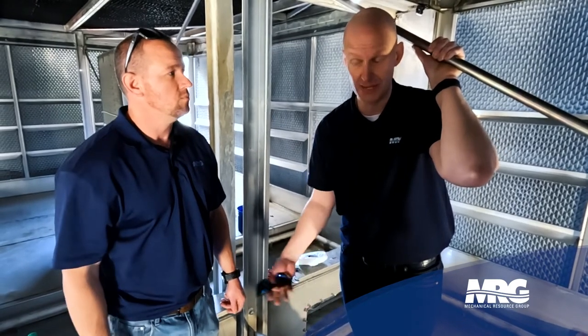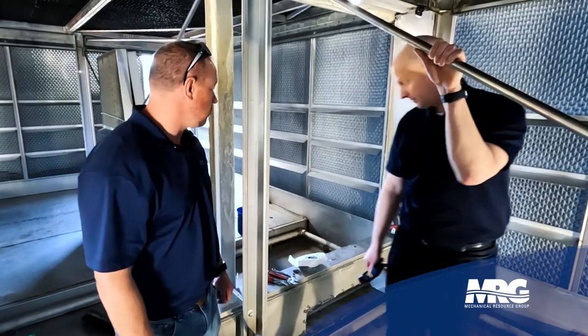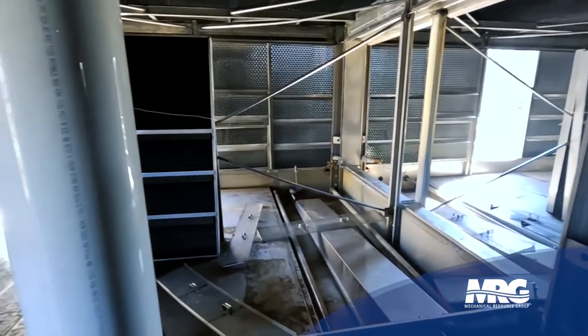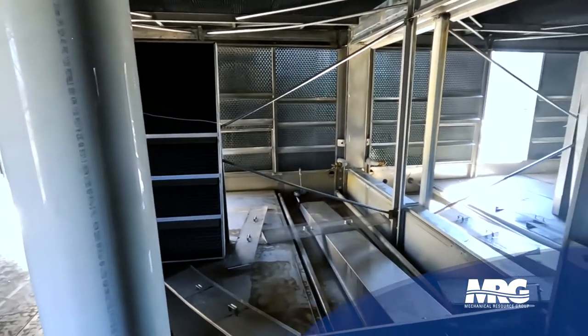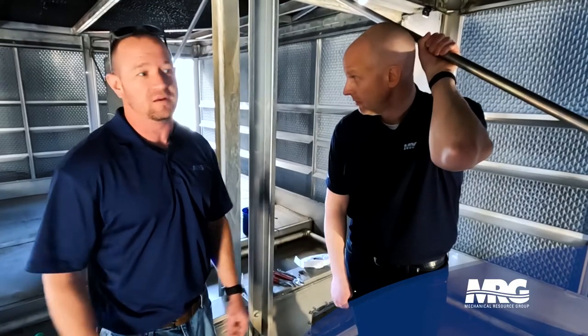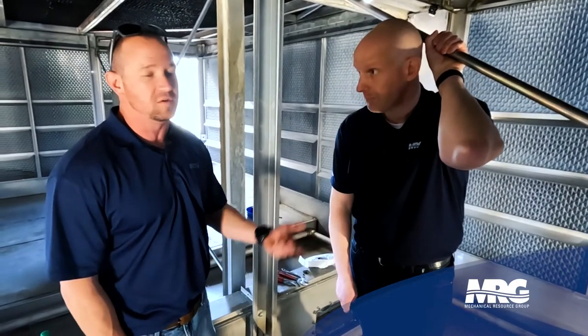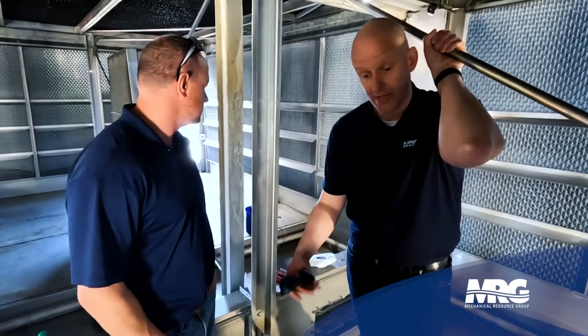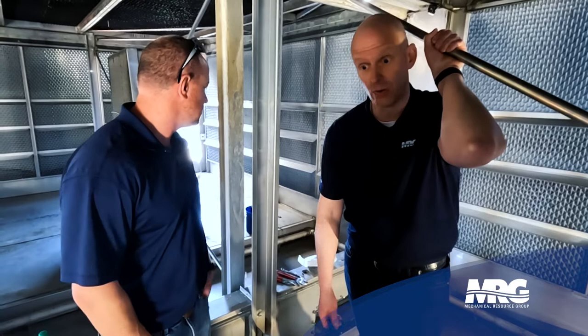It's really important that your cooling tower is installed properly and keeping all that water inside the tower. The chemicals we use to prevent scaling and inefficiencies in the tower are expensive, and if we're losing water we're losing chemical too. Another benefit of the counterflow design is you can clean the entire basin everywhere, and that keeps dirt from getting into the system — whether it's a chilled water system or whatever system it is, it's a great advantage.